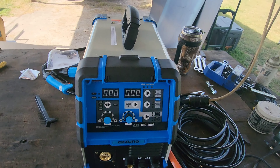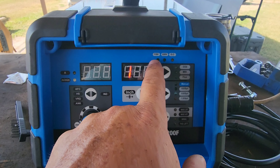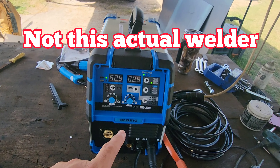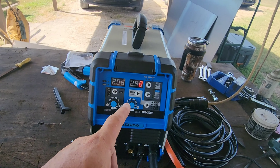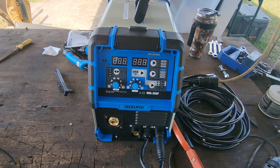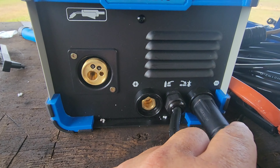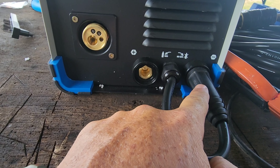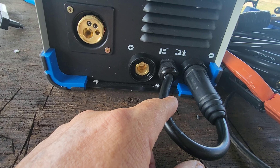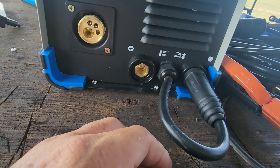I have it plugged in to just 110 to show you the power right here. You have a spot that says 110/220, and you're overheating indicator. I have welded on this thing since the beginning of February — welded hard — and it's never overheated. It's got a constant fan that works back there. It tells you it's for all-day usage — they all say that — but this thing has worked flawlessly. Come down here to the ground: if you're using flux core it stays here; if you're using gas it'll go here. When you're running stick weld your ground goes in here and your stick side goes in here.